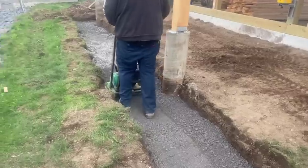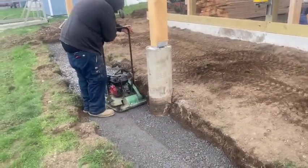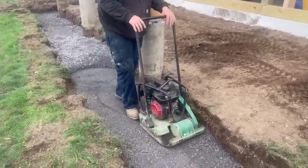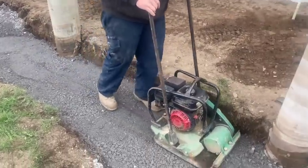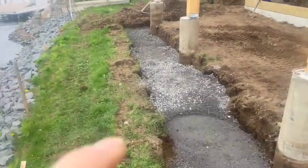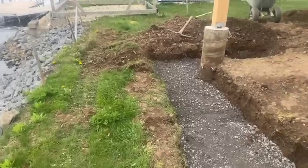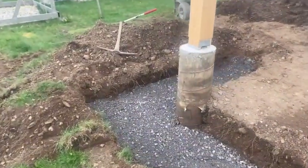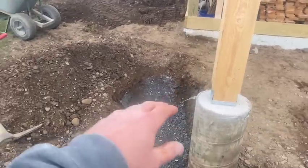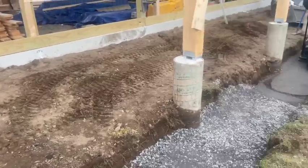Tamping our limestone for our footer — we've got about 8 to 10 inches thick here. The tamper's down good. There's going to be a step up here because the elevation changes, and it's going to come around the corner. We're also going to step up one more time. We've got foam board in there, so that's how we're doing it.